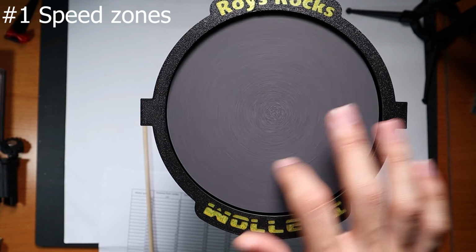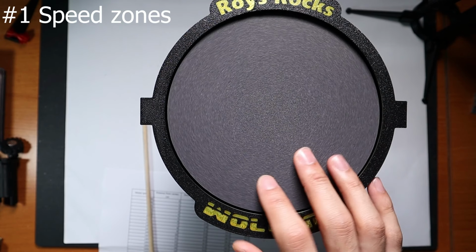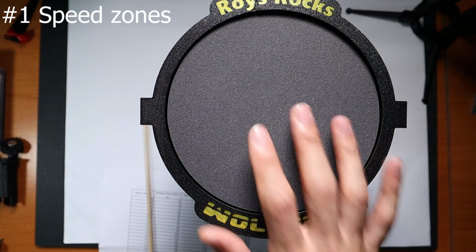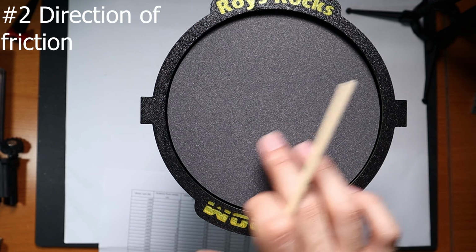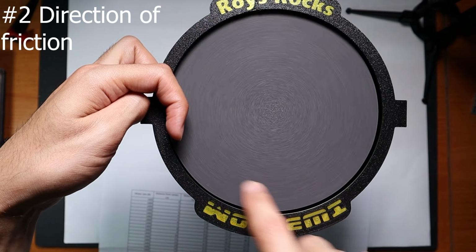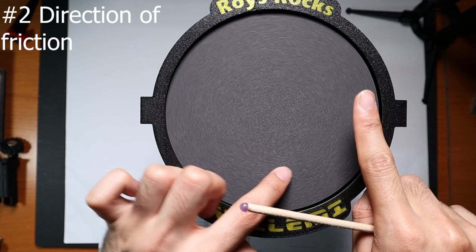It's the one key difference with flat laps compared to the cabbing wheels and even the burrs. The burrs are quite set in terms of their surface velocity when it's in contact with your stone. And now I'm also saying speed and velocity, but this is velocity dependent. On this side you can see the surface is going in that downwards direction, but at the same time it's going in the upwards direction here.